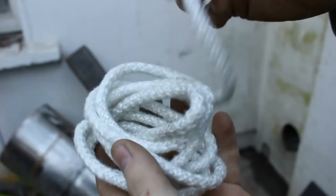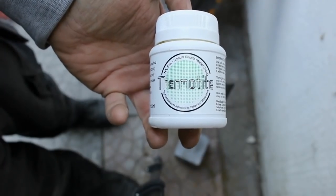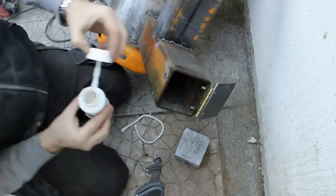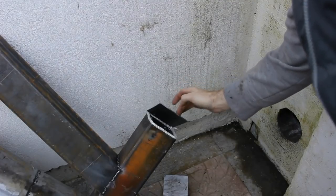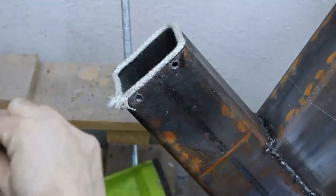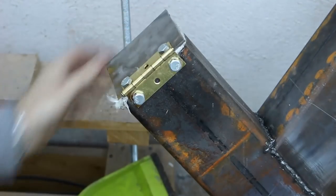This is some stove rope I got from the local DIY store and I'll attach this around so when the door seals it's completely sealed. This is specific high temperature glue used to hold stove rope in place — I use it quite liberally and the stove rope just tacks onto it and you can use it straight away. Then I ran into my second mistake with the door in that it wouldn't now close because the stove rope is too thick. So I took it off and widened the holes which gave me a bit of play when I screwed it back on. After putting it back on I have plenty of adjustment — I close it up, tighten it up nicely and now it forms a very tight seal.